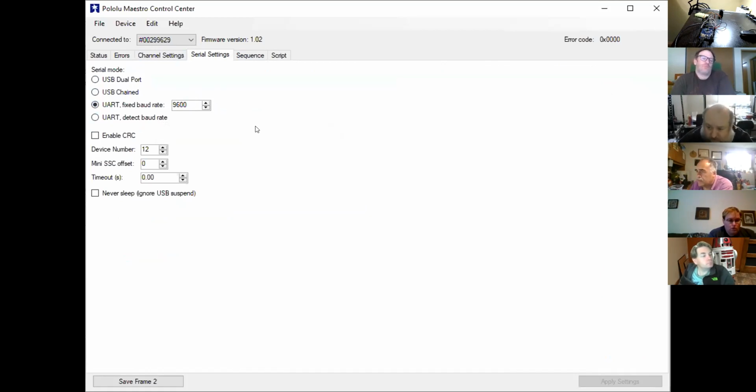But honestly, when you're first playing with these things, just go step by step. Get your Arduino up and running and working. Connect your serial ports up. Make sure you've got power going to both of them. Get just one servo on there and get it up and running and working. Because once you've got that, you've got the confidence that you know what you're doing, and then you can start to get onto the more complex stuff that you're building around your particular droids.